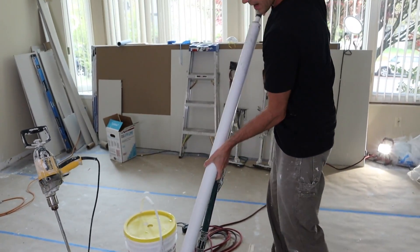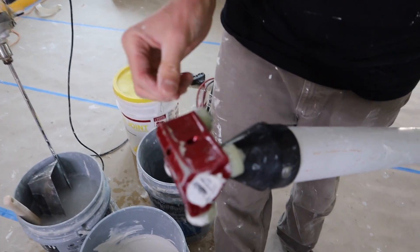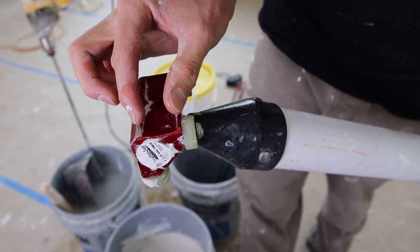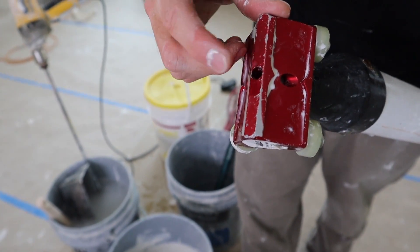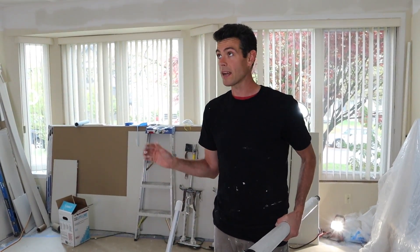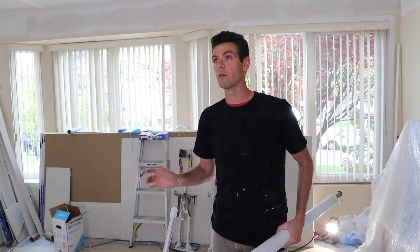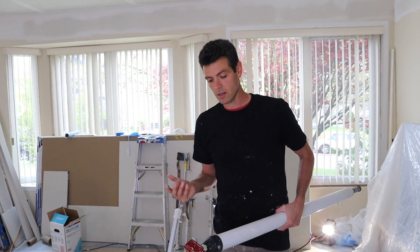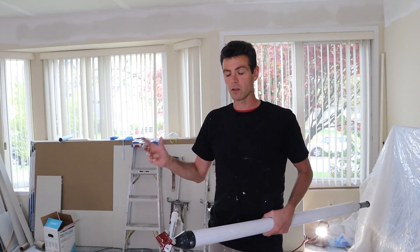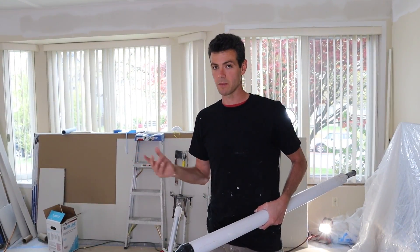So what do we have here? I think this is a Better Than Ever corner applicator. It's like a little choo-choo train shape, but you can see it's going to leave a little one-inch bead of mud all across there, and a bit in the exact corner as well. Another thing I didn't get into is when to do this — I do this before my first coat. So it's all taped and I haven't started coating anything. The reason I do this before my first coat is when I come back for the final coat, if there's any extra work needed in the corners I can do it the next day. Whereas if I did my corners on the second coat, I wouldn't have that extra day to tune stuff up.